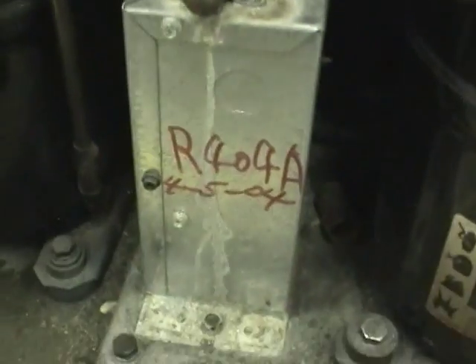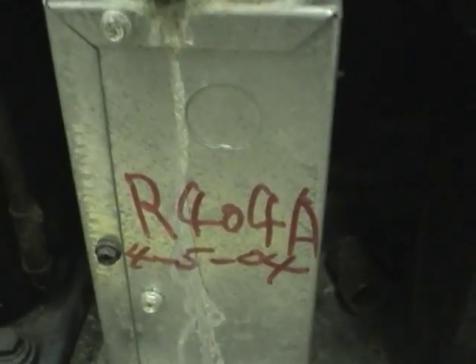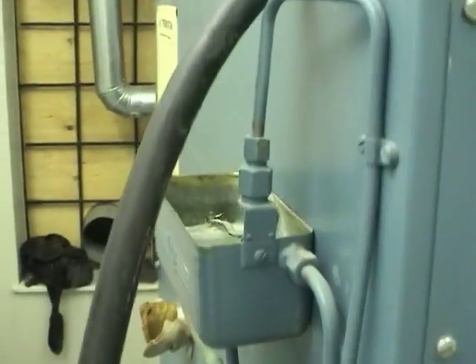There's pressure cutouts here. Someone's written R404A - that's one of the refrigerants. I think they both use different types. I think this is for the humidity control to inject water - water must fill in one of these pipes. Here's another drip tank with a float.